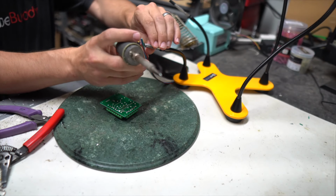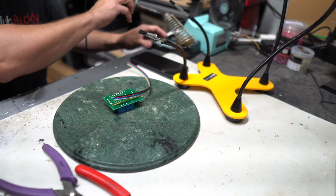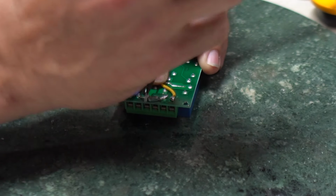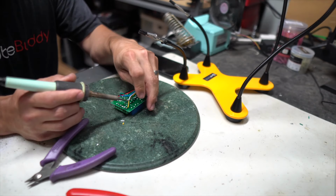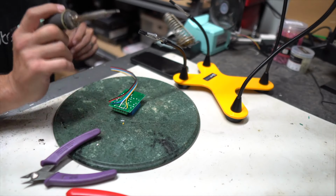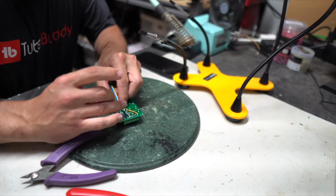And the next step is yellow wire first. And then next, separate all the wires out. Our white wire needs to go there. I don't want it to touch that little wire that's above it. I'd like it to just be exactly to length, right there. Solder that. Again, just make sure that you're conscious of anything that's around there, so nothing gets soldered where it doesn't belong. Now it's going to start getting pretty interesting looking on here.